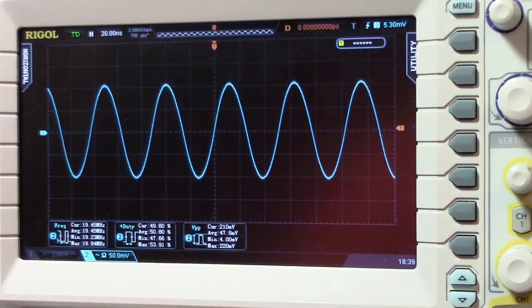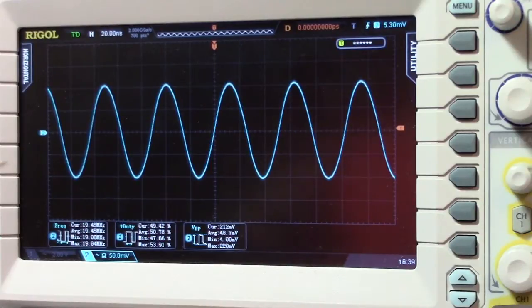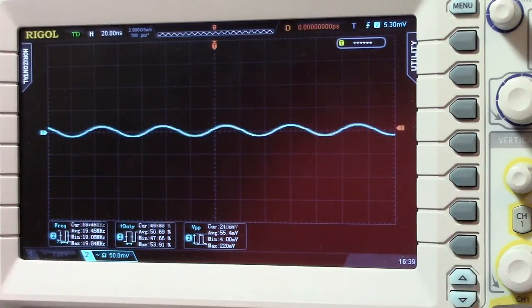Now that means, and of course this is in, when we see this little lag, it's when the attenuator is coming out, which means it's when the pad is being pulled out of the RF pathway, and we'll see this a bit in a second when we take it apart. That's really weird. That means there's probably not a contact being made very well somewhere. Let's continue on with the third one.